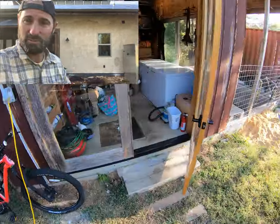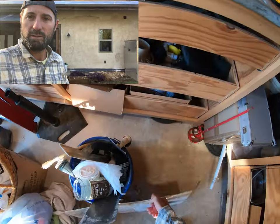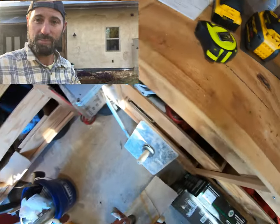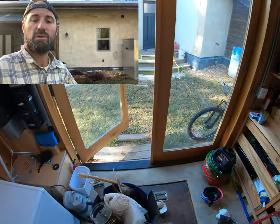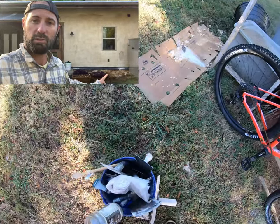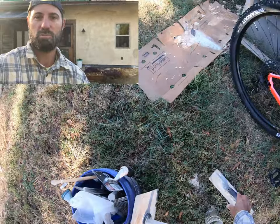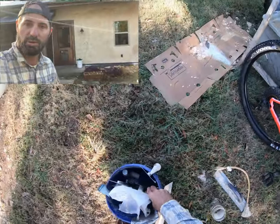And if we do continue to have problems with cracking, we're gonna add more sand. More sand and less lime is gonna reduce the amount of cracking that we see. So if we need to add more sand, we can do that. I don't think we're gonna need to. I think we're gonna stick to the one part lime putty to three part sand mixture to make this work. And that's what we've been doing in the past, and it's worked out really well.